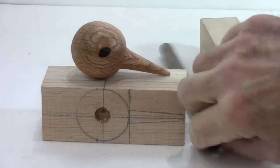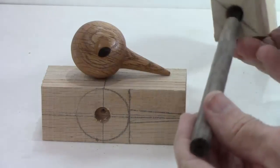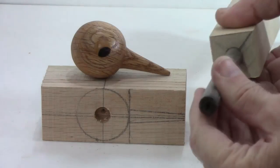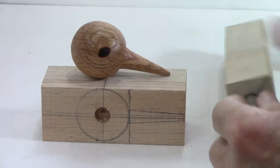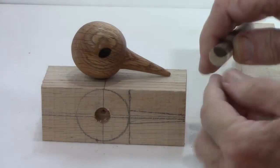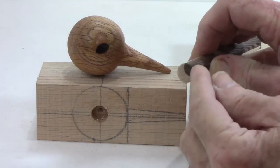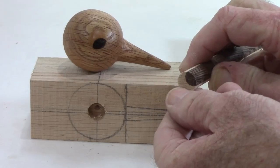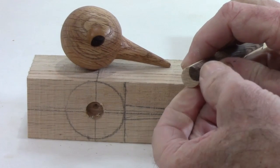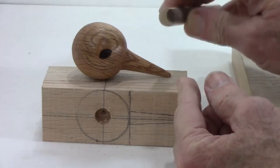Basically, we're going to turn a dowel a half inch, and then we're going to place it inside a blank of maple that's about 1 1/4 inches, and then we're going to turn it off axis with the center just between the white and the black wood, and that way when we turn it we're going to wind up with this particular type of shape.